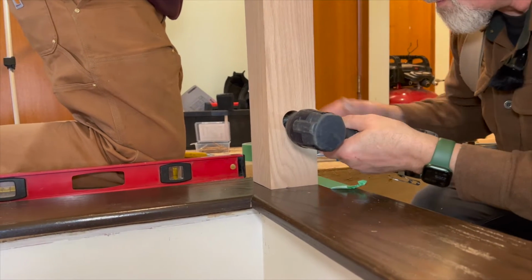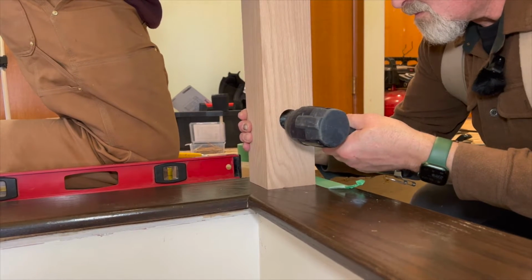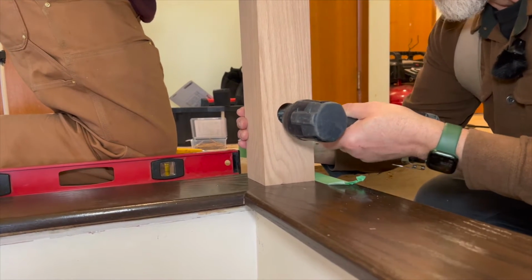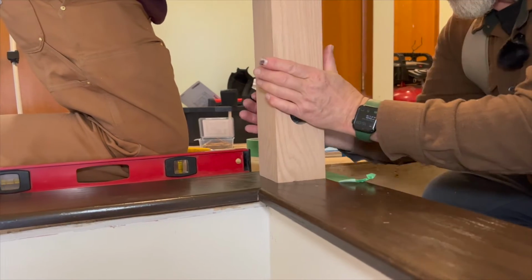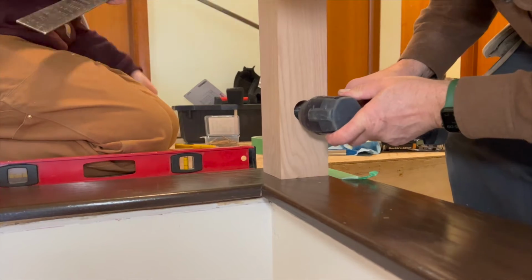In Ontario, the building code says that Newel Posts must be integrated into the floor joists. So the Super UT does just that. It is a very good way to install Newel Posts, especially on balconies or at the top of a flight of stairs.